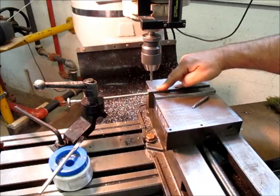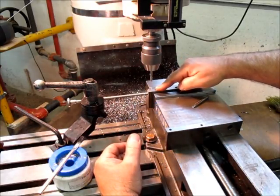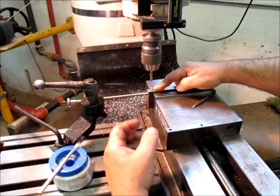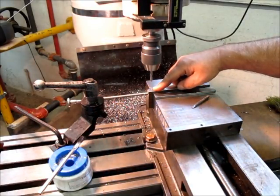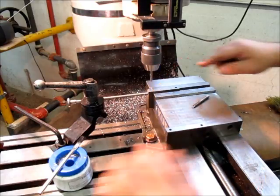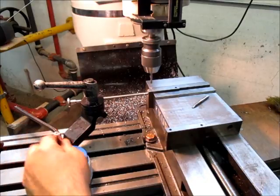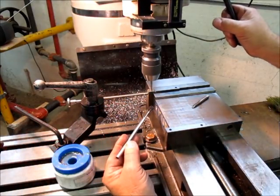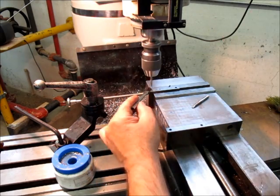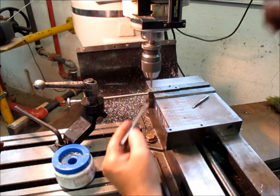When I slide up against here, I expect to feel a crisp clack when I touch the stop. And if I feel a dull little thump or whatever, then there might be a chip there. So it just clues me in to take a quick look. So trust your senses, they're alerting you to anomalies if you'll pay attention to them.